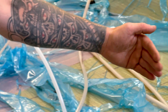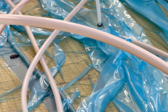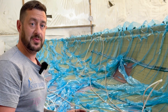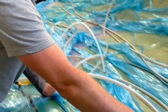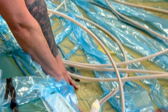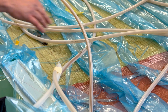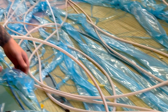We start in the middle, shoot the resin in, and it pumps across. Every time we get to the next resin spiral, we turn that spiral on. We're generally shooting around five to seven hundred millimetres distance, to ensure we're getting the resin where we need it whilst it's also curing. We've also got resin transfer mesh — a mesh that can be placed down on monolithic areas where there's no core material to support resin flow, allowing resin to flow between the bag and the material. We then put resin castles in position where the resin pipes plumb in, and all this has to be done before we apply the vacuum bag.